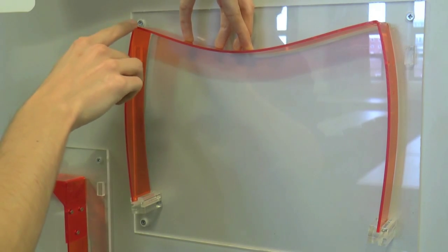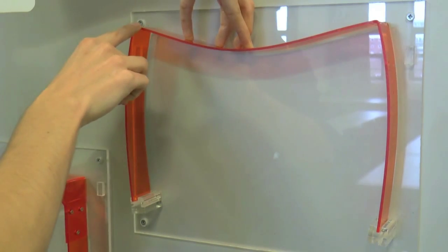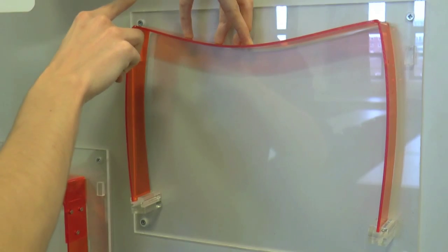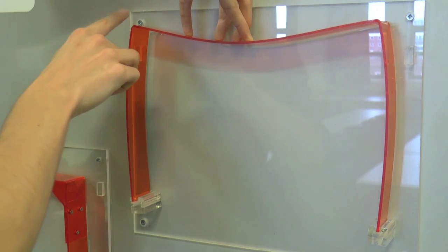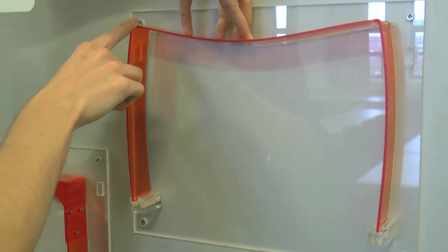So on top of that original form of bending moment, we're going to have a hogging moment generated at the corners, the ends, the supports of this beam. So there's going to be a hogging moment, and that will be superimposed on top of the sagging moment, the parabolic distribution, to get a slightly more complicated shape of bending moment diagram.